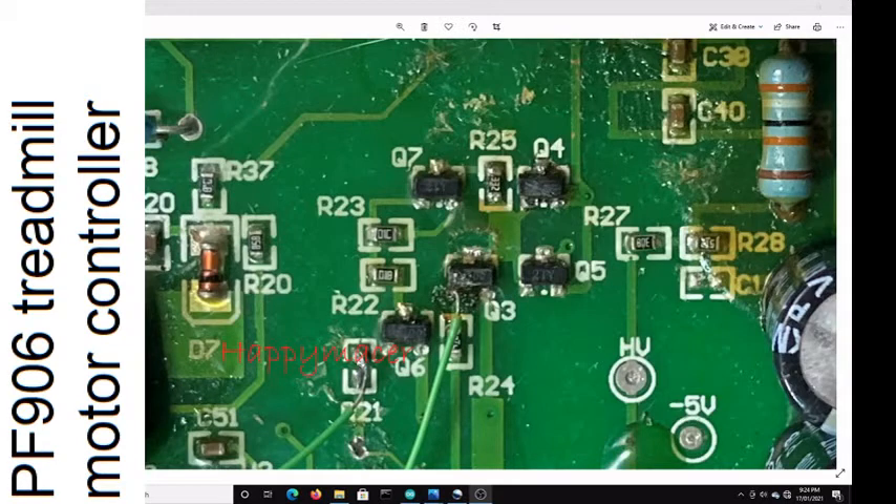This is how I connected my Arduino to the totem pole. R21 connects onto the base of Q6 — that's the power output control. There's the damage I was talking about and the chip is missing. The PWM wire goes onto the base of Q3, only because it was a convenient spot to solder onto.